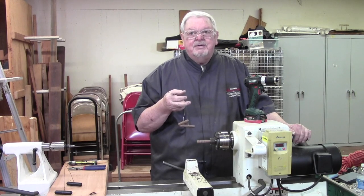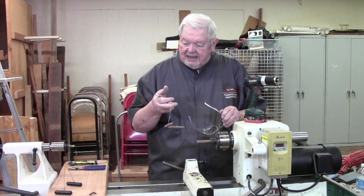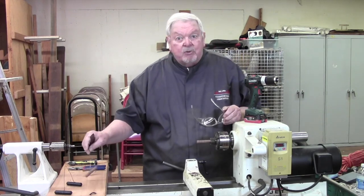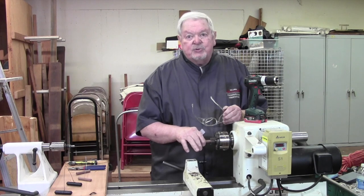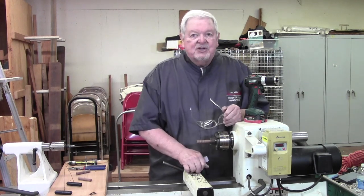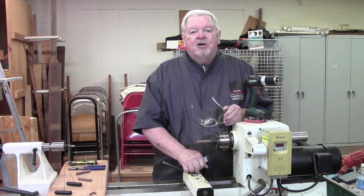So find a dowel, a piece of plastic, an old pen blank. Guitar strings, sturgeon leader, steel bell wire — whatever you can find that's rough, not copper, not brass. Braided or twisted would be nice too if you can find it. Make up a nice set of burning wires — it always decorates up spindle projects. Hope you have fun doing this and using your new burning wires. We'll see you in the next video.